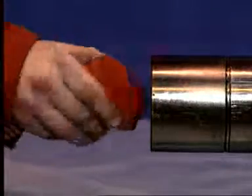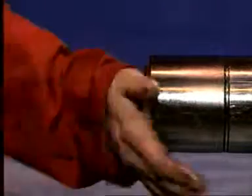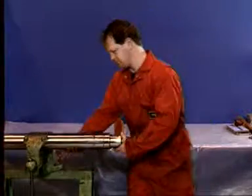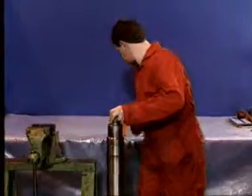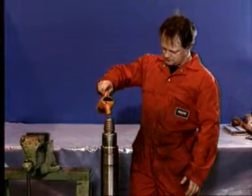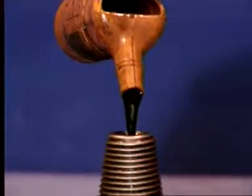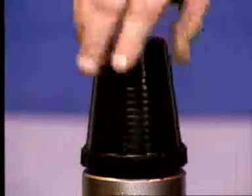When the hammer has been assembled, refit the bottom protective cap and stand the hammer upright. Pour 1/3 of a litre of airline oil into the hammer to protect it during storage. If the hammer is fitted with a non-return valve, depress the valve to allow the oil to reach all the internal parts of the hammer. Refit the top protective cap and assembly is complete.